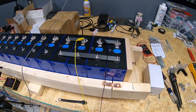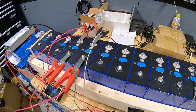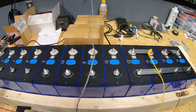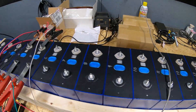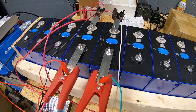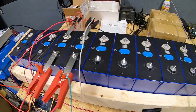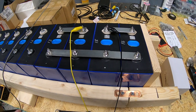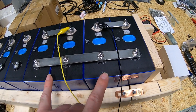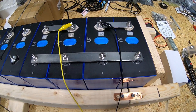Welcome back. I want to do a quick video showing the status of where we're at with our charging. We've made it up to batteries four and five in a row. We've been working backwards from cell 16, and we've got cells four and five on charge — should get done later this evening. Tomorrow we'll start working on the final three for this particular pack. The original four cells that we're going to do our load testing with have been in parallel for about two days, and we'll get those into a series configuration and then set up the load test.